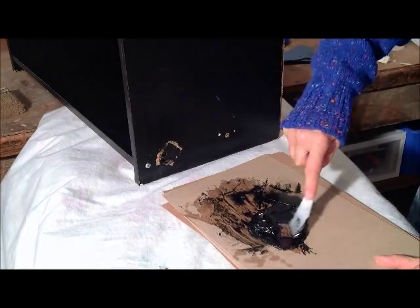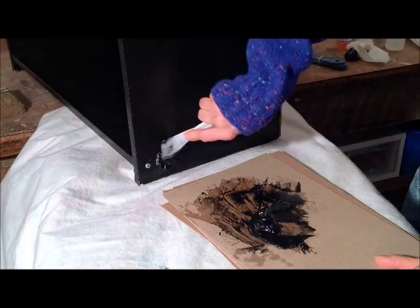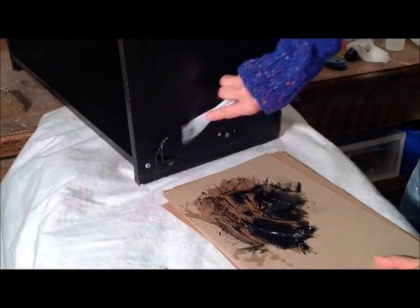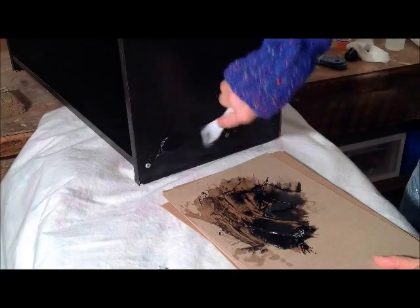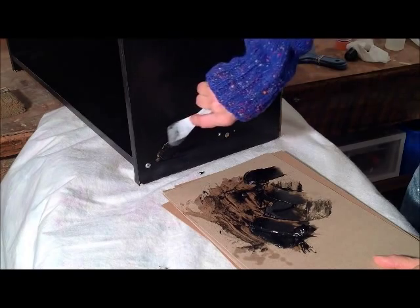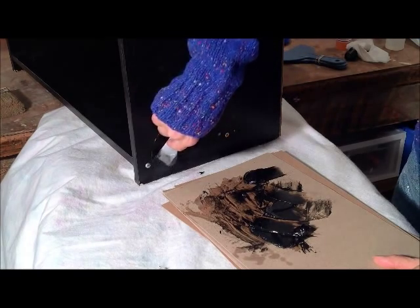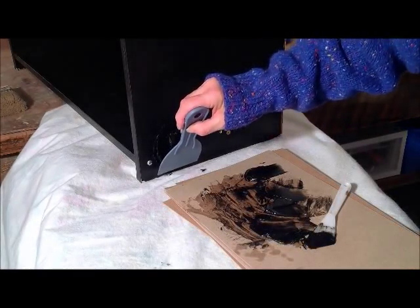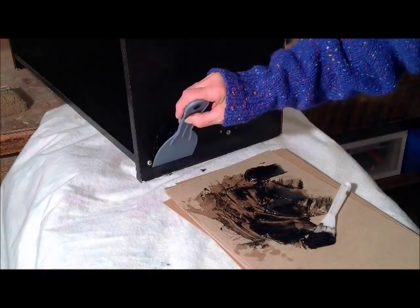Apply the epoxy to the repair and work it into the hole, being sure to fill all the edges of the repair. Finally, screed off the surface of the repair to create a smooth finish.